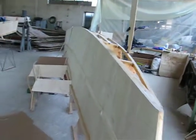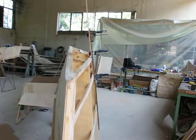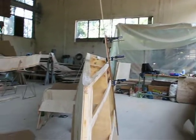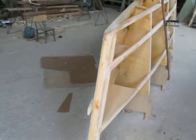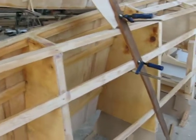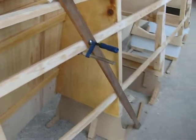In the vaka I've put in 3.7 centimeters of keel curve. I want the keel curve to help balance the boat — the keel goes like that. This has all been epoxied. I'm going to try and seal this boat as much as possible and take it out of the water to let it dry as much as possible. That's just an example of a blade that could be used as a rudder.